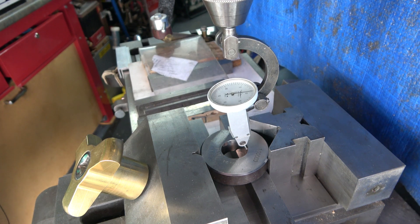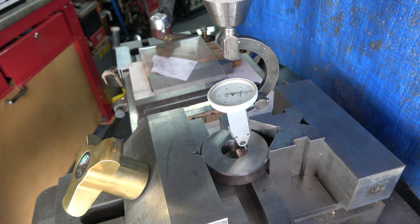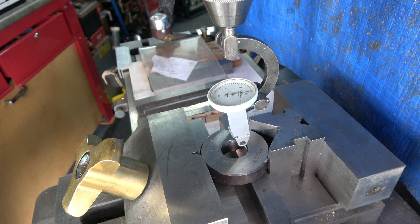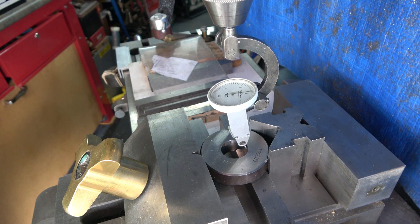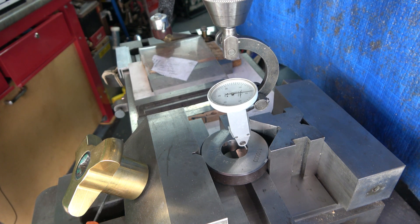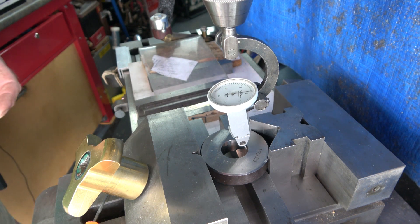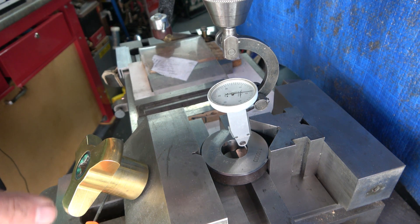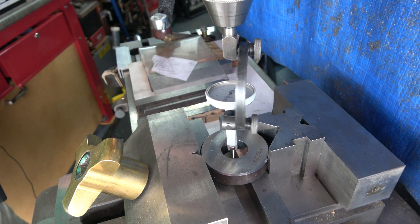The way to achieve that is generally up to you whether you take the backlash out in the clockwise or anti-clockwise position — that's your choice. What I always do, even on a machine with a DRO, is always work in the clockwise position. So what we need to do is rotate this round so that the stylus is at the front.